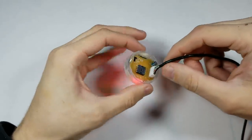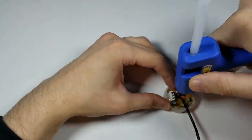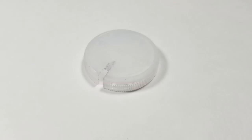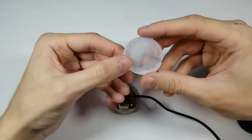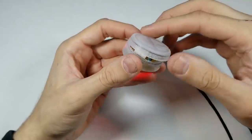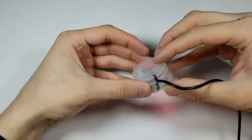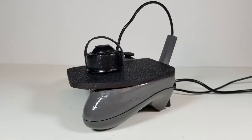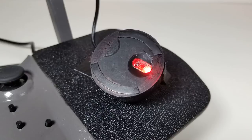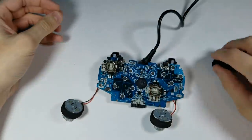After purchasing and disassembling 10 plus mice from all different brands, I quickly discovered each mouse manufacturer uses a different layout for their optical sensor on the PCB. This was an extremely expensive task, but it did result in finding the perfect mouse PCB I needed for this project. The second challenge we faced was creating a sufficient amount of space on the front of the controller that can emulate a full-sized mousepad. Reducing the size of the overall mouse from the size of your hand down to just the size of your thumb helped tremendously.